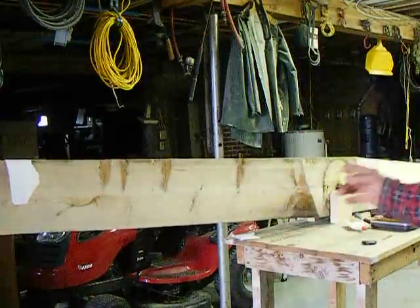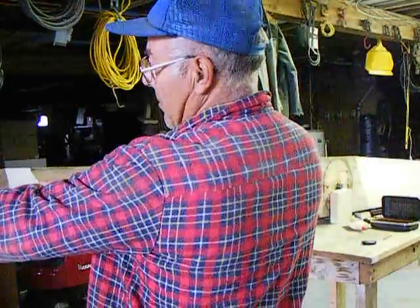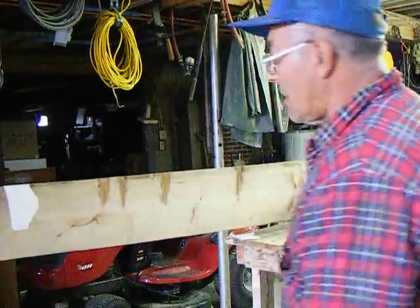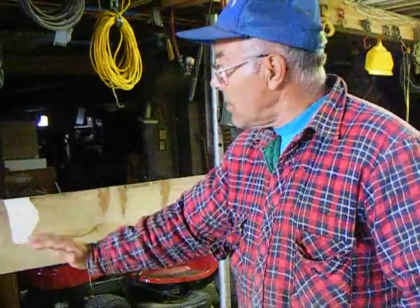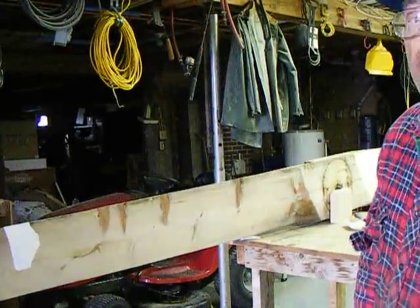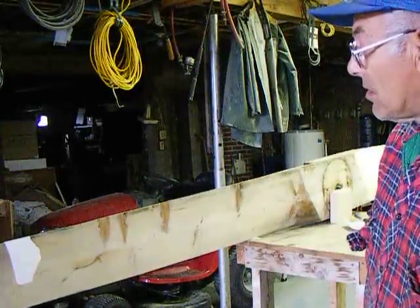You can balance that blade by putting paint on it. Usually I have about a foot of thread on the tip. Two coats on — one coat on each side is too much. So you put another coat on the other end, and if you have to, just one side. That's all you need. It's that critical. A 12-foot blade — you don't need much being off to cause vibration.